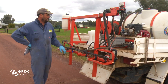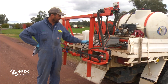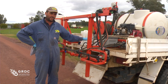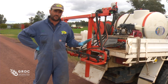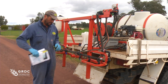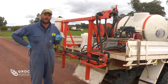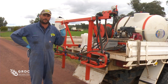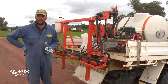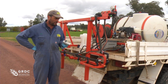Some of the tools we're going to need for the job: we're going to need our measurement so we can get our width figure, some markers just to test and lay them out on the ground. We've already done our pressure test and we know that the pressure here and here is the same. We have our nozzle chart to refer to, to see what our width is going to be. A little tip - when you're driving and doing a fence line sprayer, rather than relying on the speedo, just get the Navman or your TomTom and put it in the vehicle and you'll get a very constant speed. This is a manual system so it's important that we do maintain a good constant speed.